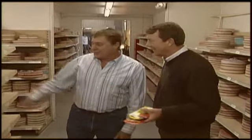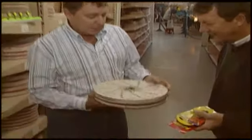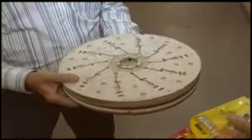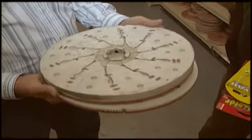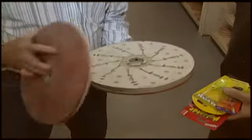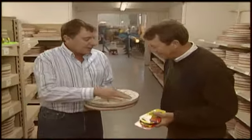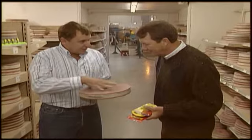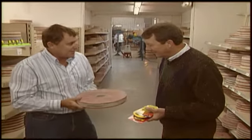I chose this room because the process starts here with a mold. We're in a whole room — it looks like old film canisters, but these are all silicone molds. This is what houses the impression for making this type of stuff. This silicone mold will have a bunch of cavities of the exact same item in it. This item is a classic spinnerbait we make for Man's Bait Company — it's been around for a very long time. We'll put the supplies in here, meaning the wires and hooks, then put the lid on it, pour lead into it, and it centrifugally fills all the cavities, which we'll be showing you in just a very short time.